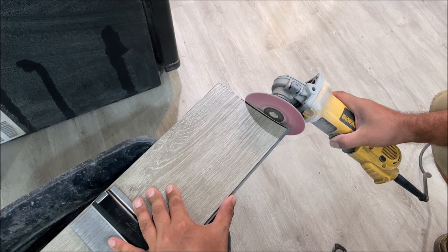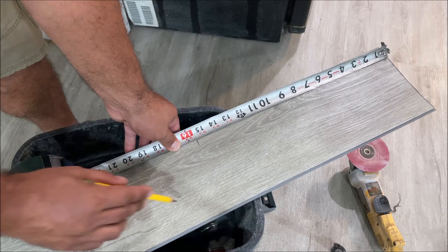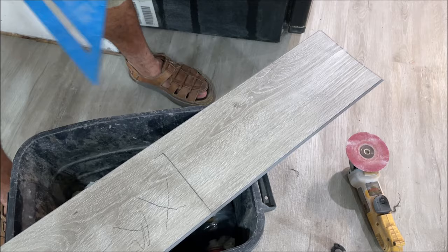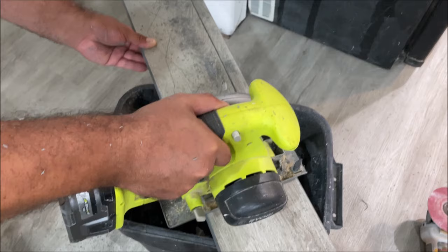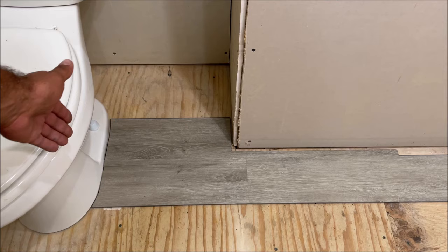We have 15 and a half from the toilet. What happens a lot is you can cut the opposites, so go ahead and mark what gets cut out so you don't get confused. This little piece here is just one inch. You can get a framing square for about five dollars — mark it, remember we're cutting that out, and we're just using this for a straight edge. Our cut is going to leave us with a long delicate piece; it's best to make this entire cut with a saw.